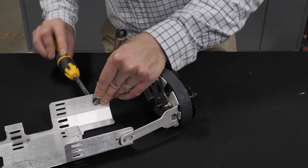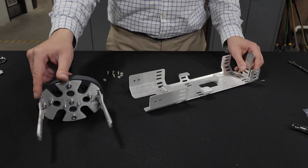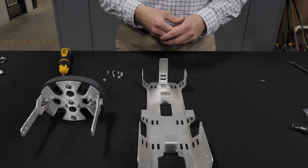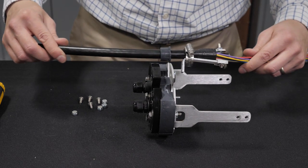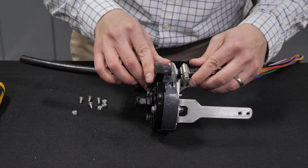Remove the seal assembly from the platform for additional room. When performing a mid-sheath splice, the platform may be disconnected from the end plate to make the cable installation into the prepared cable ports much simpler. Place a bead of silicone along the inside seal of the elastomer. Insert the grommet into the elastomer and tighten down the standoff nut to the inside plate assembly.